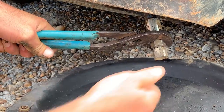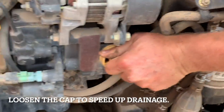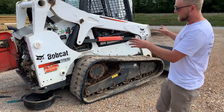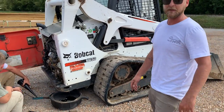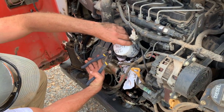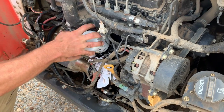That was actually really easy. We tilted the machine a little bit backwards to help make sure that all the oil gets out, because the way we were sitting it was at an angle where there was a chance some would be left in afterwards. Using the filter wrench — last time this thing was changed was March 3rd, 2020, at 1,287 hours, and I think we're at like 1,804 or something like that. Just spin it off quick.